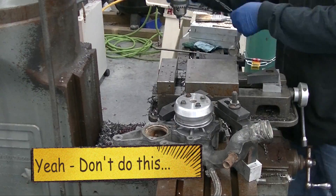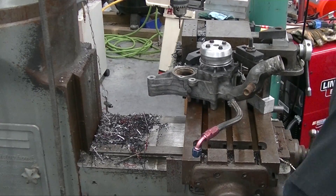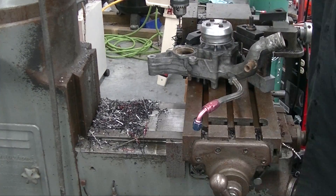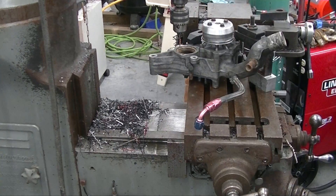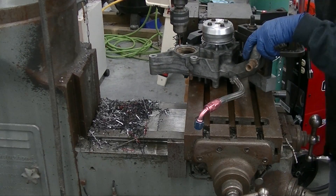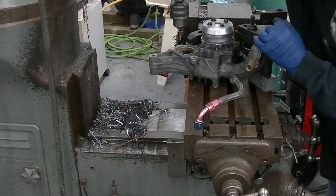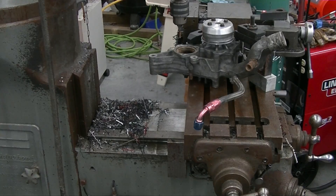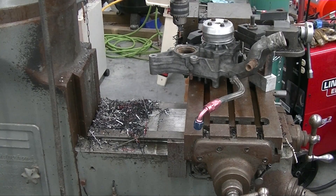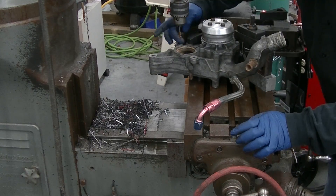Next thing — don't do this. I got away with it, but I was using a 3/16th 3-flute end mill, and the hole is actually an M6, so it gave me a little bit of room. Then it's just lining it up. You'd be amazed how well you can line these things up visually — if you've got decent eyesight, you can get in there. I was just gently pecking at it where things were broken until I got a solid, nice flat surface and could see where things were going. Once I cleared the chips, I did make a slight adjustment on the Y axis just to center up a little bit better, but I had plenty of room and everything was fine. I think this part of it went really well.